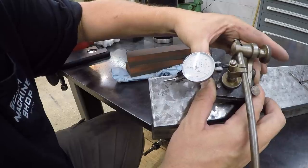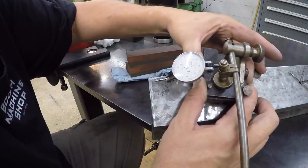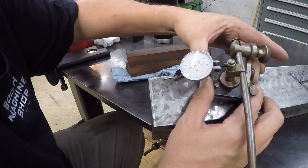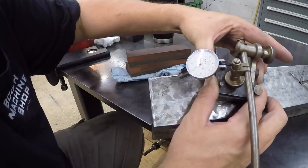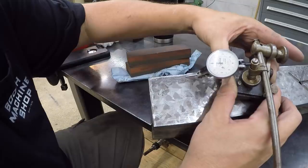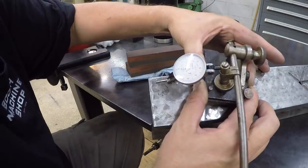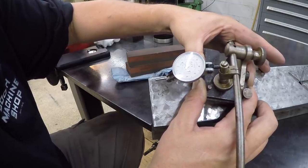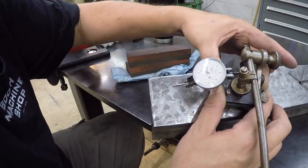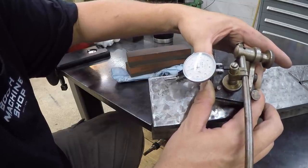So that's a machined area of the gib, and as I sweep across, it comes up about half a tenth. I'm sorry, half a thousandth now. That is a tenths resolution indicator. I'm just showing you what I'm doing anyway. I had it a couple thousandths, and now I've got it knocked down to where it's pretty well even back there. I got a little bit more right in there, so I'll keep working it. Those low spots, that's the flaking. That's the oil flaking right there. It drops off right in there. So just a little bit more right in there.